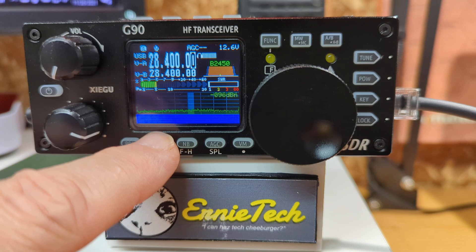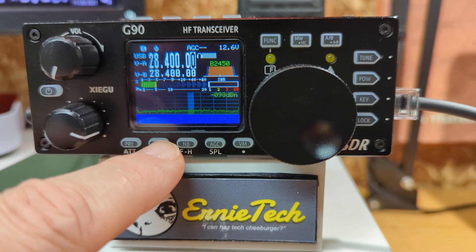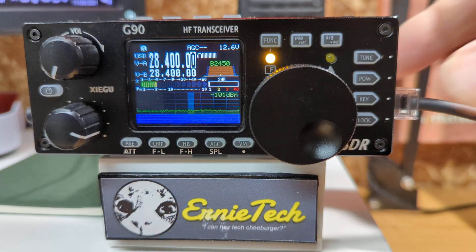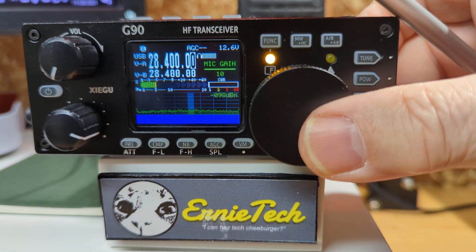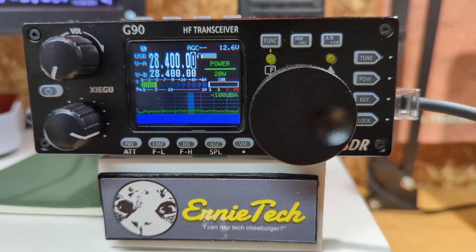I would have liked for the compressor to be adjusted so that it would stop the clipping that was occurring at the top. I might actually turn the mic gain down now — so we'll go to function, go to PAL, mic gain 12. Let's take it down to 10. Turn that off. It's still got 20 watts — that's effectively what it can do.